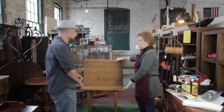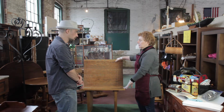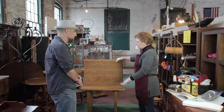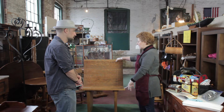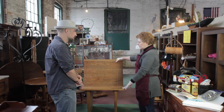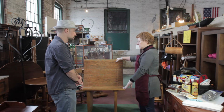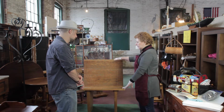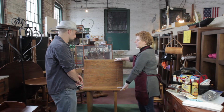Okay. And of course, the kind of products we're talking about, people can get here at the Olde Engine Works, right? Yes, that's correct. Unlike some of the other hardware stores, we carry all 9 shades. And we also carry the wax and a heavier duty paste wax. Depending on what you want to use, after the Restore Finish, I like to seal it. It keeps the wood hydrated and stops any splitting that might happen, and it actually seals the wood after you've restored it. Keeps its finish much longer.